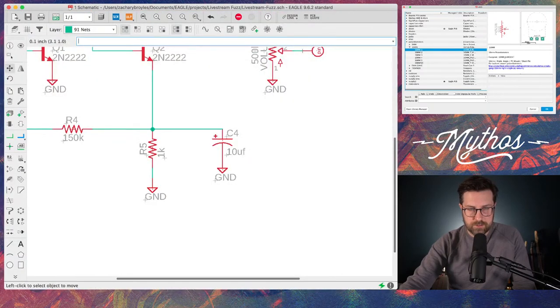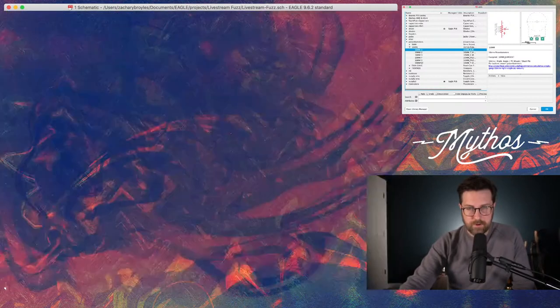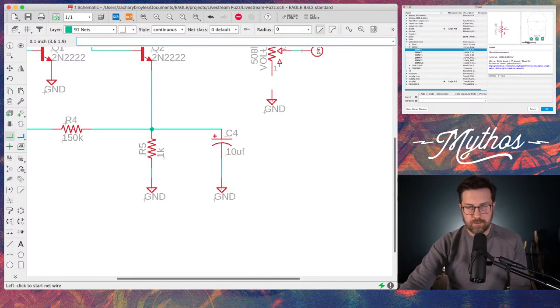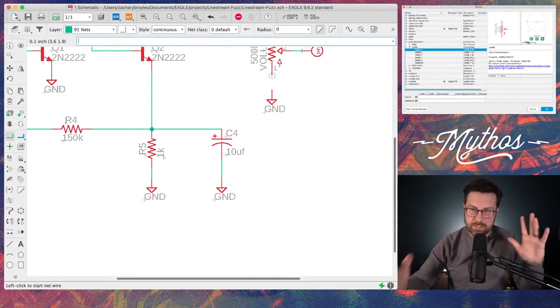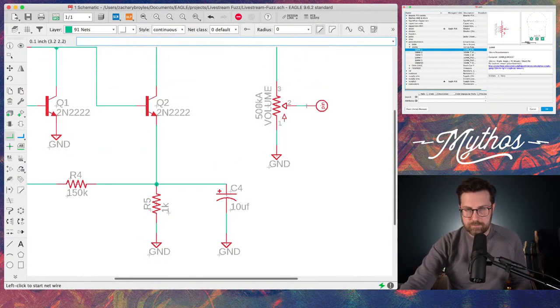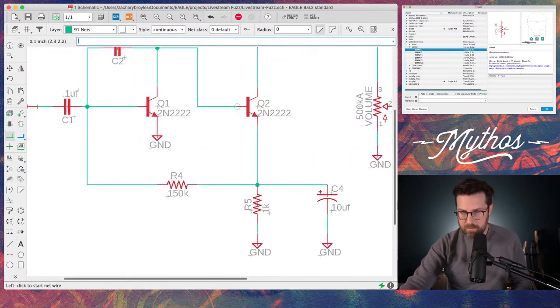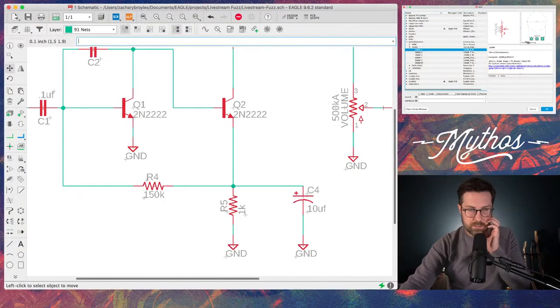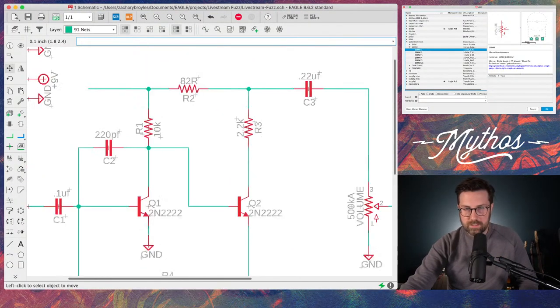One thing I like to do, just to make sure that you can see that ground connection is there, is pull it farther away from the component itself, and you can see there was no green net in between that pot and this ground because it overlaps slightly because of the spacing of the components in Eagle. There we go. So now all the grounds, I'll double check this one. That one's connected. You can see a little green net there, hopefully.